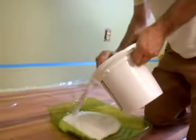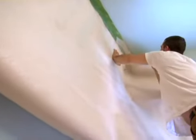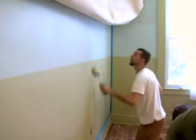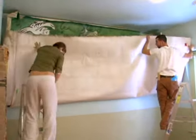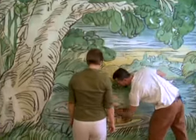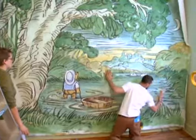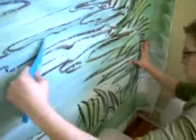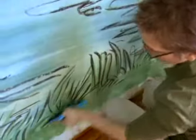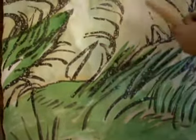Gluing. Fold up and pin the lower half of the image. Glue around obstructions with a brush and the flat wall with a roller. Unpin the top half and lower both sides together. Using a soft brush, gently press in an outward motion until all the wrinkles are out. Then, using a plastic blade, firmly press the fabric into the glue, working each area several times.